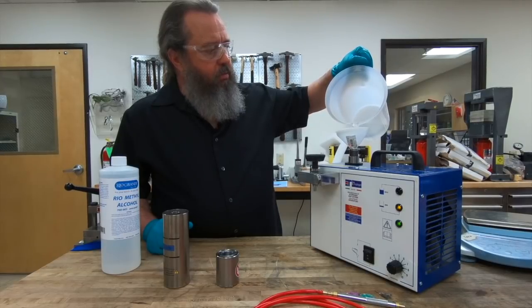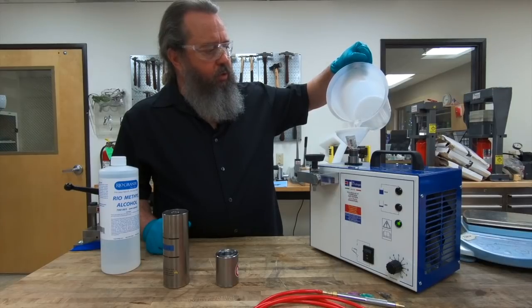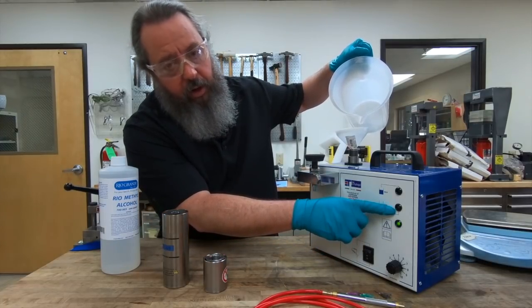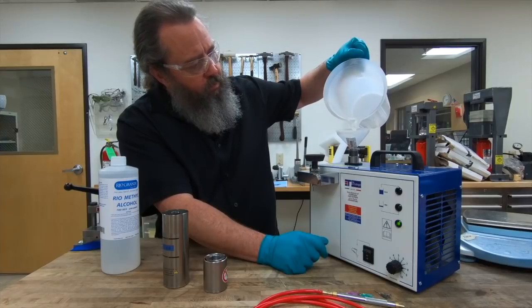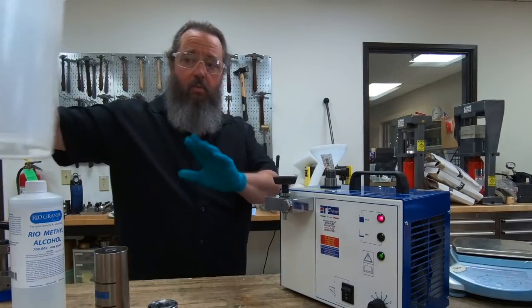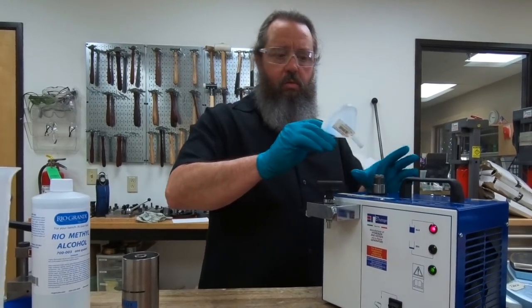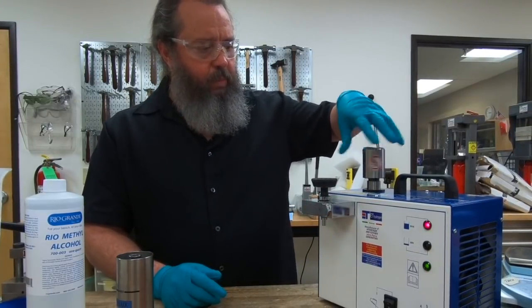Start to fill the machine — this is going to take a little while, so take your time. You don't want to spill any of this solution. A good thing to have is some vinegar handy; if you do spill it, you can use the vinegar to neutralize the solution. You can see now that the yellow light has gone off. Continue to fill it up until the red light just comes on — there it is. Now stop filling; you don't want to fill it any more than that. Make sure the funnel is empty, then go ahead and put the safety cap back onto the machine.